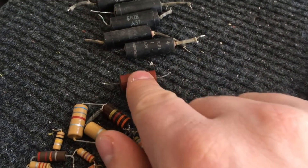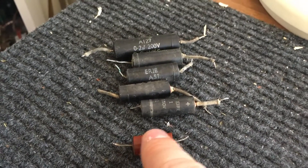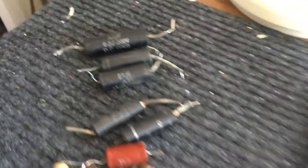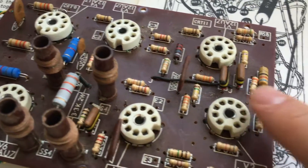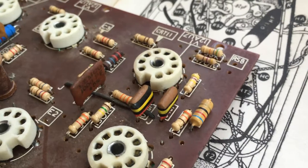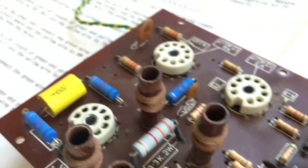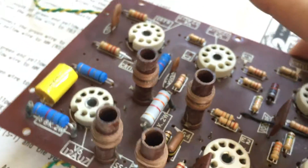Here's all the caps. There was this capacitor here — it was leaking at 25 volts. I will show you all the leakage tests. The two 16 microfarad electrolytics were leaky, and these three moulded caps as well. Looking at the board, the three tropical fish caps — one, two, three — were all good, no leaks, they're rated at 250 volts and they are good up to that voltage, so they can stay. And all the other disc caps test good as well, which is great.